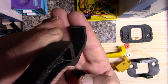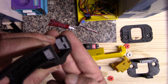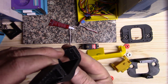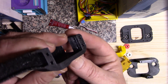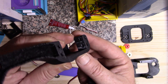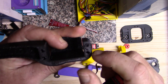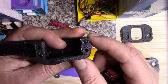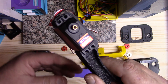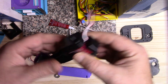This design also uses embedded nuts. There's a little slot — you sit your nut on top and then heat up your soldering iron and press it down into place. Some people have opted for threaded inserts instead, using the same holes and soldering them straight down. I went with embedded nuts, which is why I don't feel like rebuilding my back two legs right now because it is a pain.